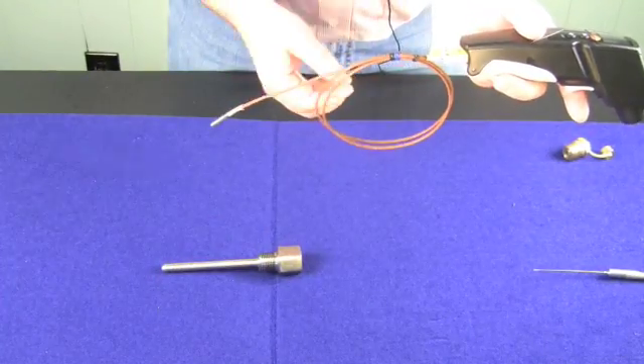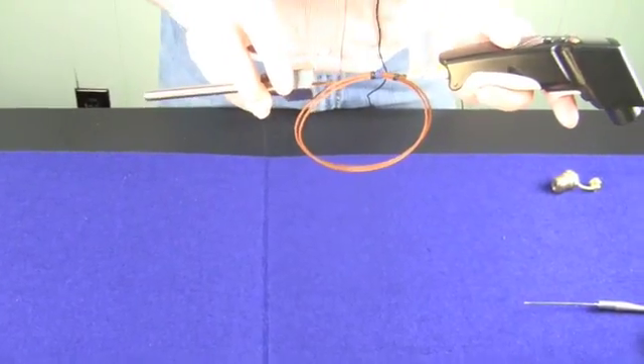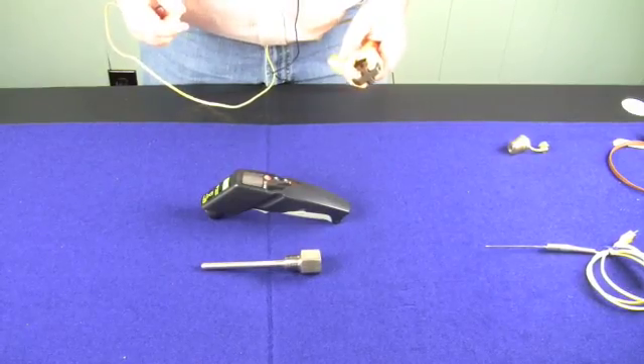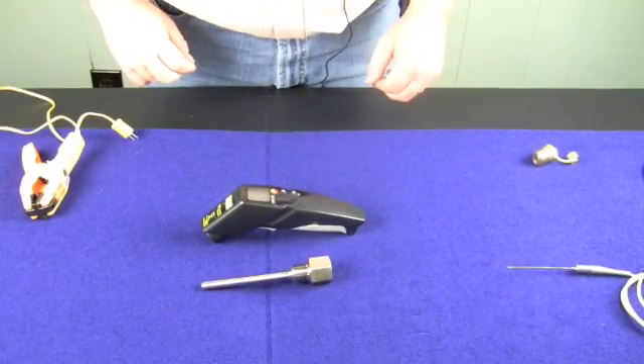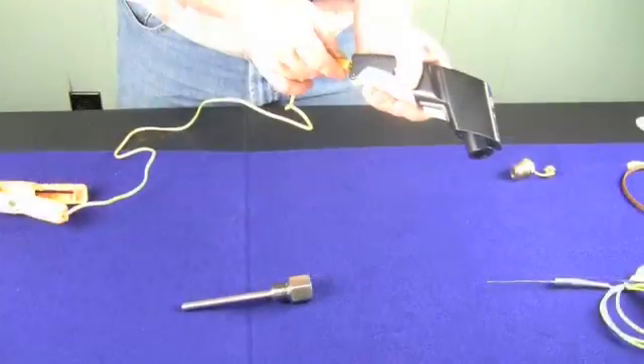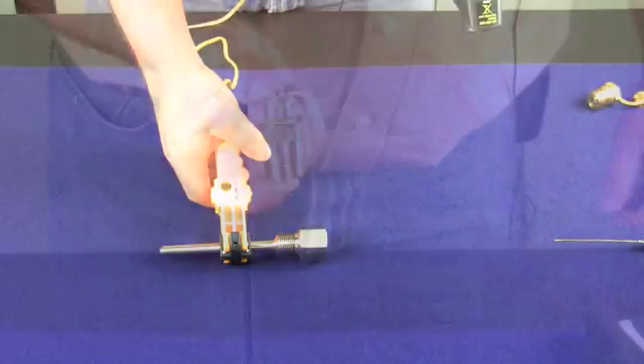Insert this into a well to remotely read the water temperature. So what would you do if you were in the field and had to read pipe temperature? If you had a Testo instrument and you were talking to Stromquist's company, we would recommend a K thermocouple clamp-on. It plugs right into the bottom and has a clamp to clamp on and give your readings digitally off the pipe.